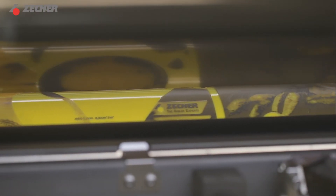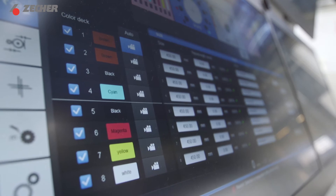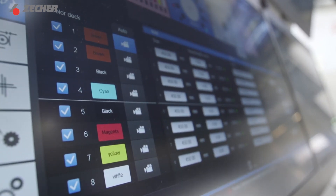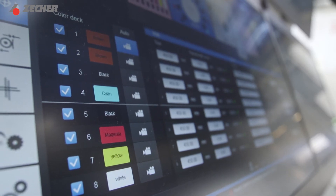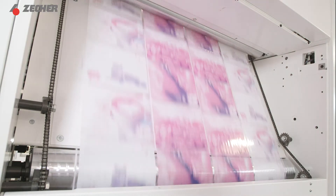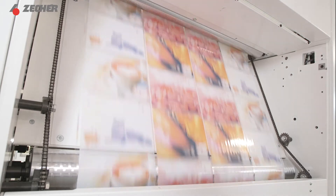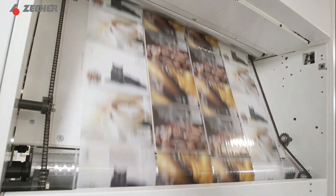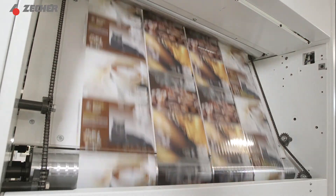As we start up the Miraflex, one by one the ink chambers are filled: cyan, magenta, yellow and black, plus the spot color brown. For this design we are using Kodak NX plates, kindly supplied by FlexPunkt. Our hexa 60 aniloxes are used for CMY and white. For the comparison, we are printing black and the spot color brown, each in two separate printing stations with our Stepped Hex aniloxes.